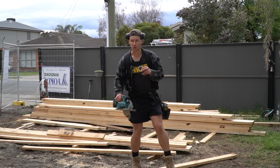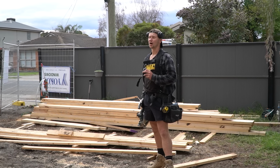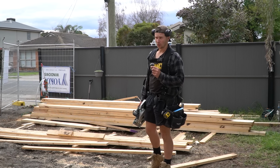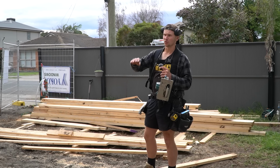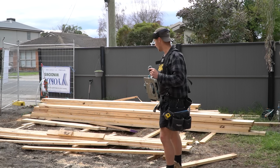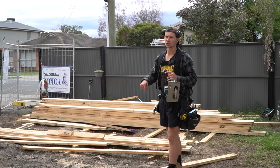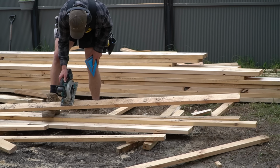All right, so Mitch is going through. He's framing at the skylights now. Boys are running through, cutting all the rafters for that carport and that storeroom. Stuff's going up. What I'm gonna do is just pre-cut a lot of timbers for our outriggers. We've got a 450 eave going around most of the rafters we have going up. So I'm going to pre-cut most of them. Hopefully by the time I'm done, Mitch is done, and we'll jump up, put the outriggers up, and build some of the end gable walls that we're going to do.